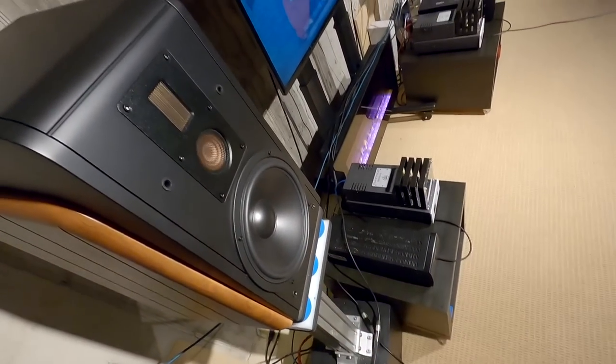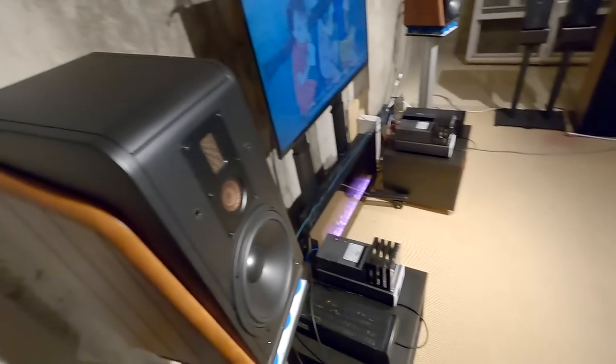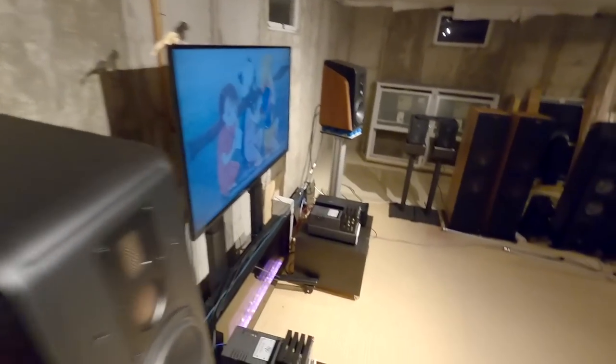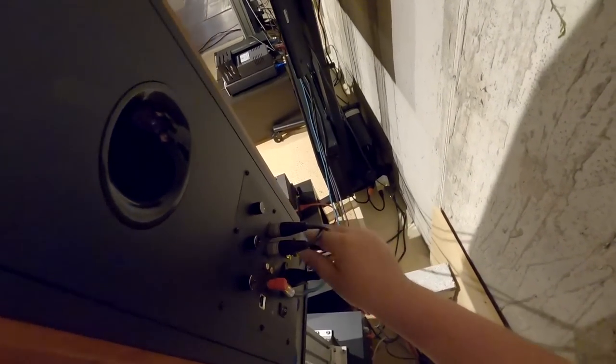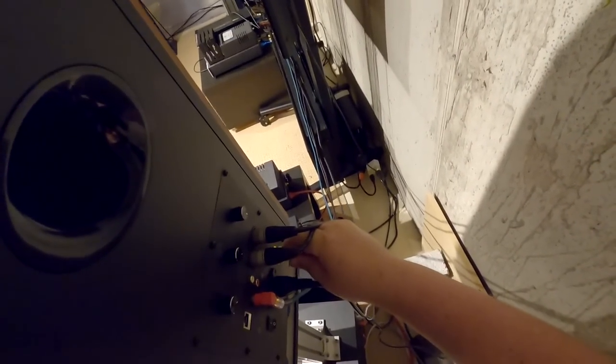That's an 8-inch, and that's the same setup they had on the little 6.5-inch. These things are still huge. And it's all self-powered. These are a self-powered set of DSP-corrected three-way speakers, relatively advanced. They have digital inputs, which I highly recommend using since this is all DSP-corrected output. And since they are using a giant six-pin lead to go from this side to that side, that means they are definitely amplifying each individual driver separately.